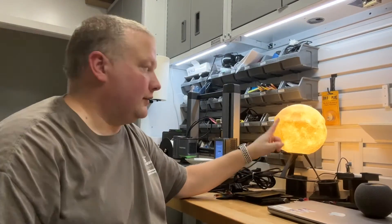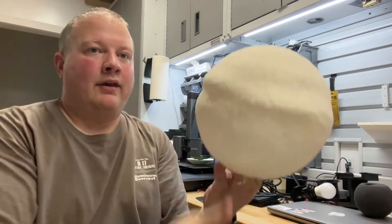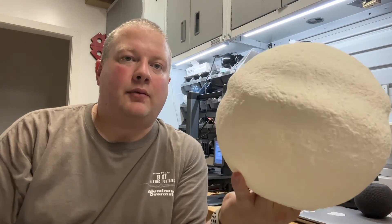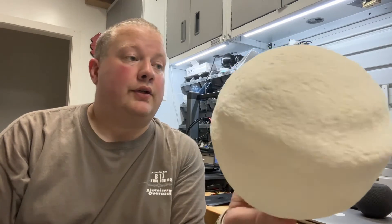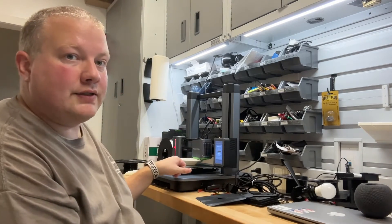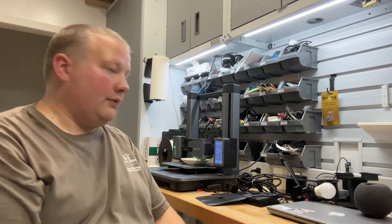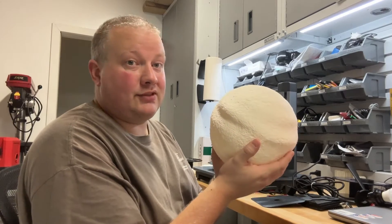Another exception is my moon. This moon is printed in white ABS plastic, and my moon has rings. I think this is the ABS problem of shrinking material after you start printing. It printed well — there are no cracks, no holes — it did well. I just think the ABS shrank and caused those ridges. I'm starting to reprint it now. There are 19 hours left on a 22-hour print, so I will share whatever comes out of it. It looks weird, but it's still cool.